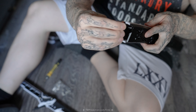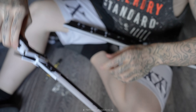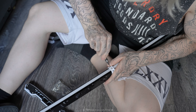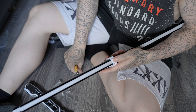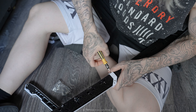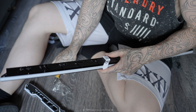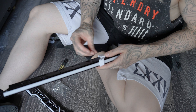That area is much thinner. So if you screw these bolts at the length they are, they might get in the way of these buttons. I'm going to use a slight bit of force just to get the thread going — yep, I feel it going in. I stop when I feel the friction increase. I don't want to over-screw it and lose the thread, because once we lose the thread it's going to decrease its strength. I think I over-screwed that one, but that's fine — there's a whole seven of them.